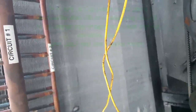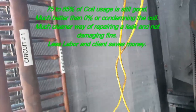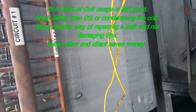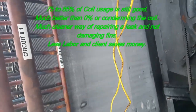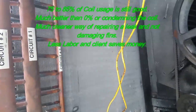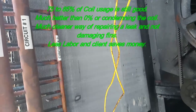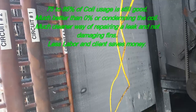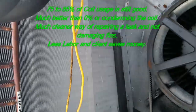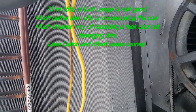They will still have sufficient cooling. They might lose about one to two degrees of temperature — we're not entirely sure — but they're going to achieve their set point temperature. If they wanted to achieve 58 or 57 degrees of supply air, they will achieve that. If they wanted to achieve 54, there's a possibility it will make it. We just need to put the refrigerant in the circuit, test it — but circuit two is completely sealed now, no more leak.